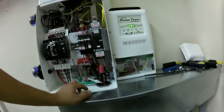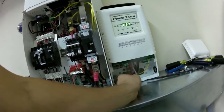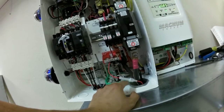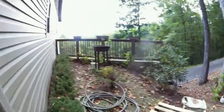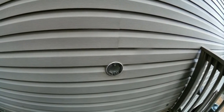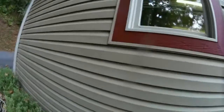We've got our battery vent fan all installed. This is the negative that's getting switched in the auxiliary terminal. This is negative power going back to the battery vent fan. The positive goes right off of the battery positive bus bar — gets a half amp barrel fuse, and then that goes straight to the battery vent fan. As you can see, she's just humming away, doing exactly what she's supposed to do. I'll take you around and show you the outside. This is one of the things that took a lot of thought when I first got into this — how to do this right — and we pretty much got a good system going now. She's running, she's vented, she's good to go.